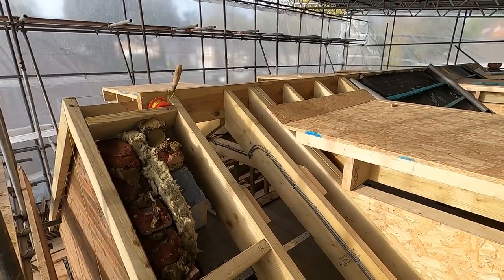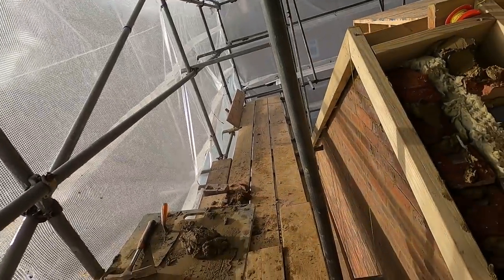Now, there's two things could be wrong here. Either my brickwork is 50mm out of plumb, or these roof trusses are 50mm out of plumb, or roof rafters are out of plumb. I put a level up it yesterday when we noticed it at my work, but I knew it was right because I put the profiles up where you've rendered, it's plumb. And yeah, it's okay. But to properly check it, I hung a plumb bob down. And that can't be wrong.